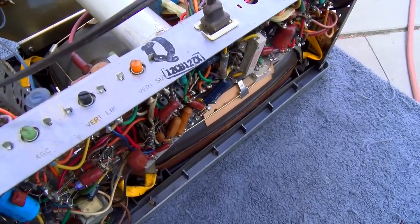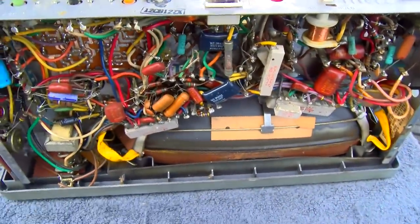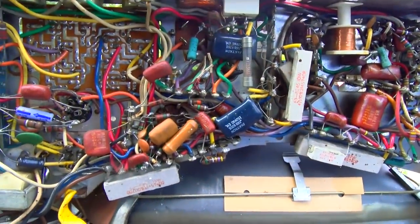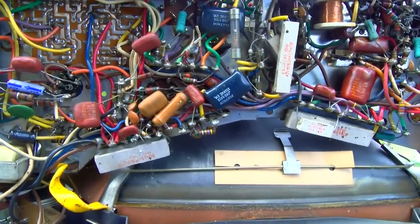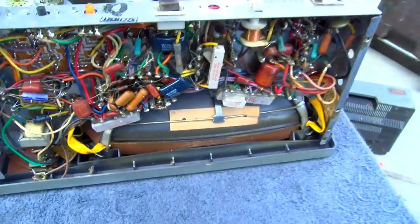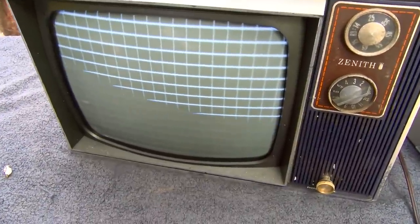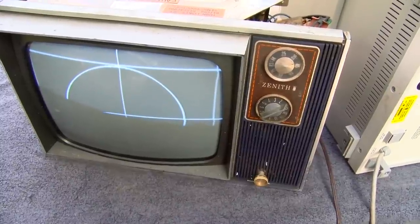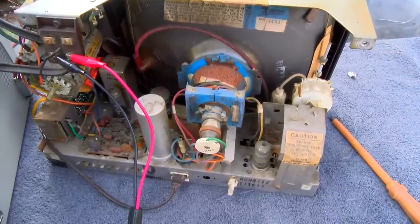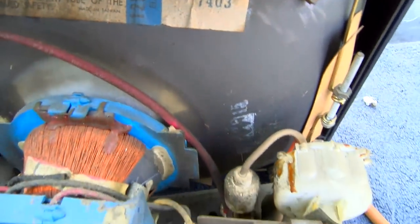Probably want to take a look underneath — it's a 12CB-12ZX chassis. Here's looking underneath at the Taiwanese hand-wired chassis. Kind of your typical Zenith. Actually, it looks absolutely perfect, as would be expected from a Zenith. This really just needs a good cleaning and it's ready to go. The filter is staying cold, so I'm going to assume it's good. Looks like we might have a date code of 7403 there, so this is 1974.